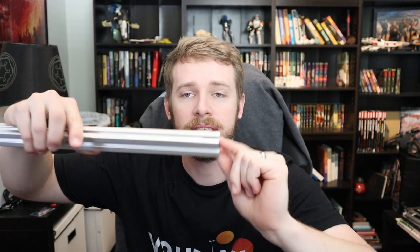Now let's talk about T-nuts because T-nuts are a little bit different. The T-nut is a little metal piece that you slide inside of your rail. You just slide it in from the end and it sits inside there. The T-nut is what you actually screw into — so if I have to attach my angle bracket to the aluminum extrusion, the T-nut is what you attach it to. Because it's inside the slot, it pulls tight and that's how you attach stuff to the aluminum extrusion.